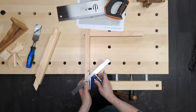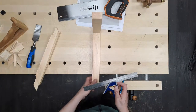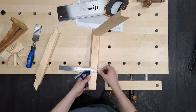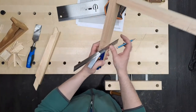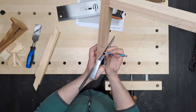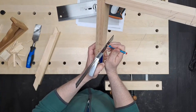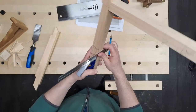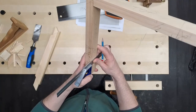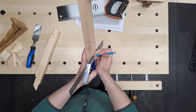A little bigger. So when we flip this over, we'll be able to see that now, I'm doing it at a slight angle for you, that now we can take our pencil line here on that. Through there. That's one side. I should have done it on both sides because it's actually going to go all the way through. These are through mortise and tenons. It needs to be tightened up to that one.